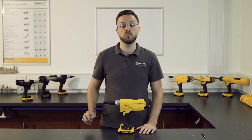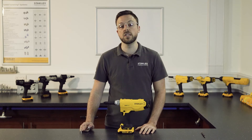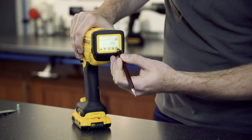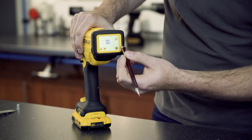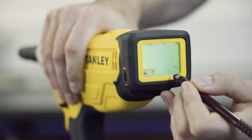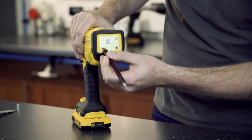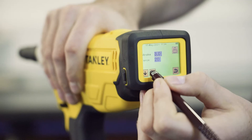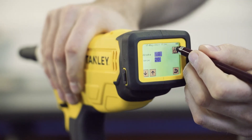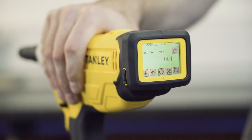Now I am going to show you an example of not-OK placement of the fastener in application. For this example, I am going to set the tool to 1mm. We first need to go to the rivet setting menu. From here, unlock the tool, enter my password, and enter. Use the up and down arrows to reduce or increase the stroke as necessary. So here I am going to decrease to 1mm. Once OK, press the padlock, set the stroke, and then return to home.